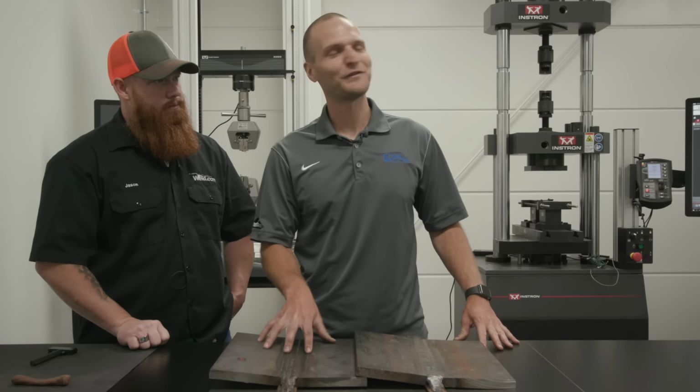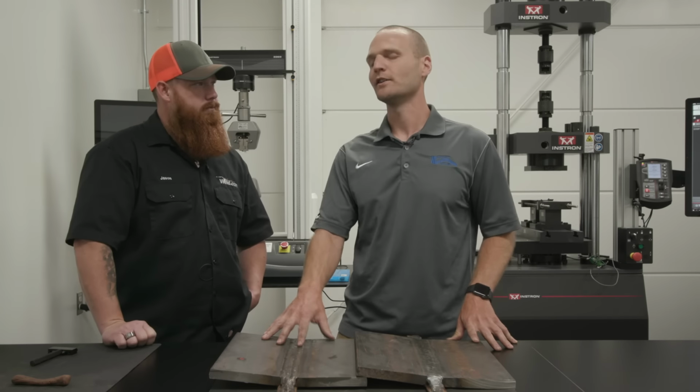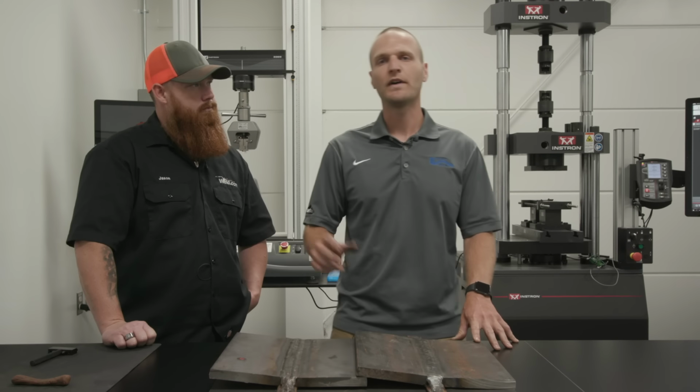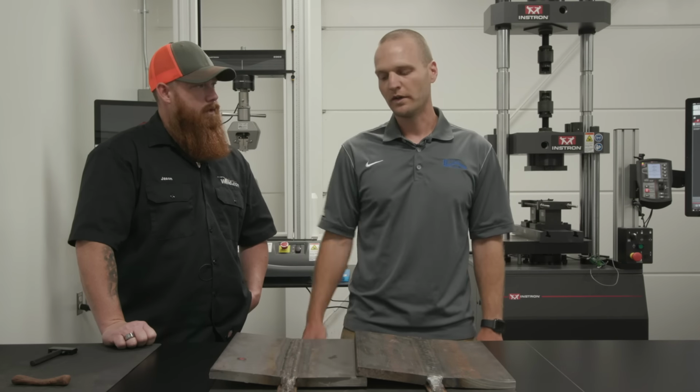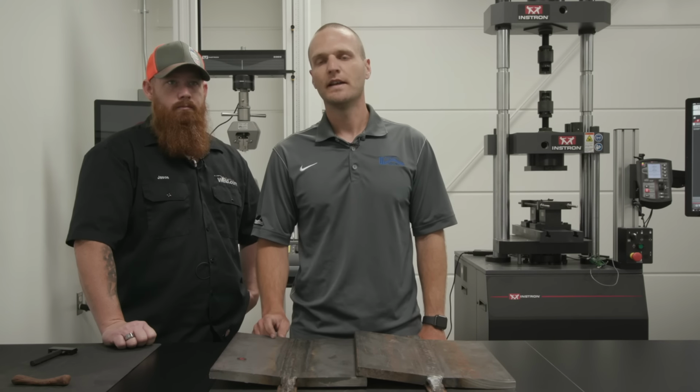That is actually if we had a 14-inch plate. We have a 12-inch plate, so right, we're basically just gonna probably test the 0F or maybe the minus 20F, but standard is a group of 5, drop the high and the low. We'll again throw that on the water jet, flake out 5 specimens, and go from there.